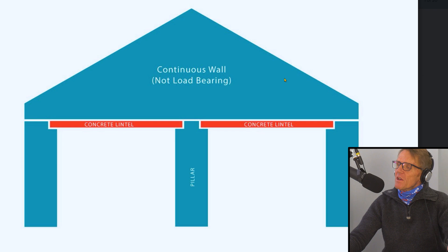If that's the case, you can see what I'm talking about with this arch effect — bricks going up there and coming down there. With a point load, because of the brickwork above, you tend to get a spread across the lintel, which is why it's important to build the brickwork in above the lintel as you go. You lay the lintel, you build the brickwork in, and the whole thing works as one. I don't know why exactly — I'm not a structural engineer so I can't give you the scientific reason — but it is clear in the instructions that that's the way these concrete plank lintels are supposed to work.